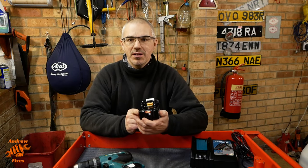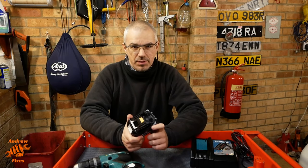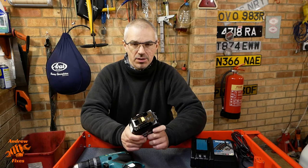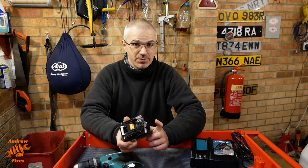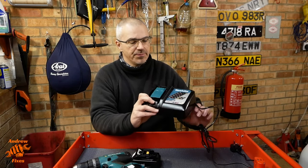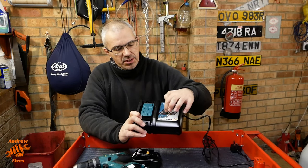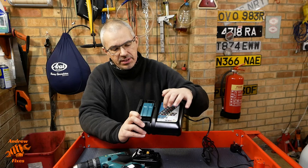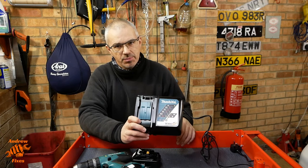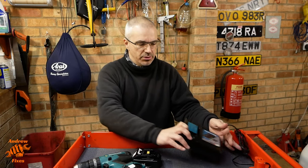This one at the moment is nearly full. On that note, if you're leaving these for any length of time they're best left at about 80% charge — certainly best not left either completely full or completely empty. The Makita charger plays a tune when it's completely full, but when the red and the green lights are on together that's where it's at that sort of 80% mark. So that's probably a good time to take it off the charger if you're planning on storing your battery.